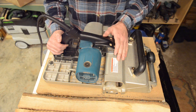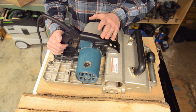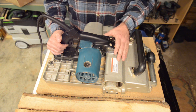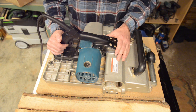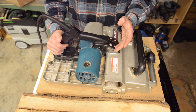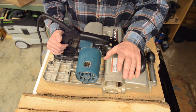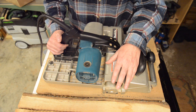The portion of the timber that has just been recently planed — where you haven't drawn lines or dropped your chisel — you have minimal sanding to do. It really does leave a beautiful finish. You'll have to do a little bit to get rid of the knife marks when you put oil on it, as they will show up, but there's not a lot of work to do after planing, especially with fresh knives.